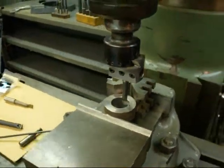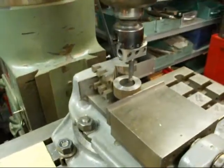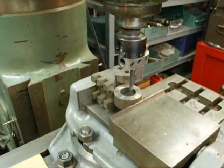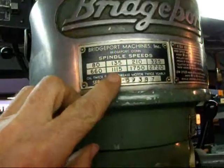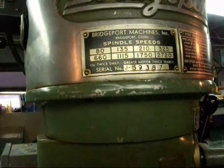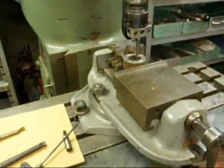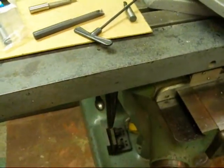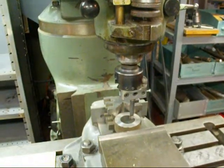Be sure and wear your safety glasses when you bore because these chips can really fly. Take a trial cut and see what your speed is and if there's any vibration — if it vibrates, slow it down. I'm at 1115 RPM and it seems to be okay. With all of those things in consideration, and the table locked in the X and Y axis — always make sure that's locked — we are about ready to start boring.